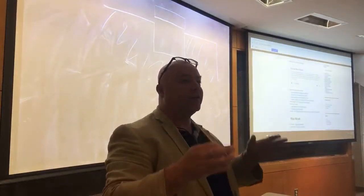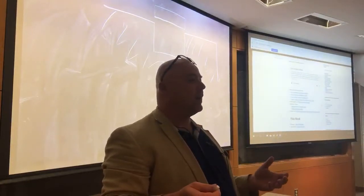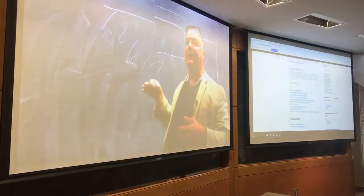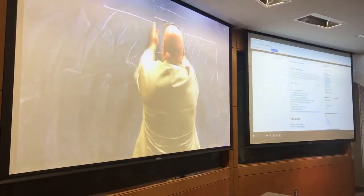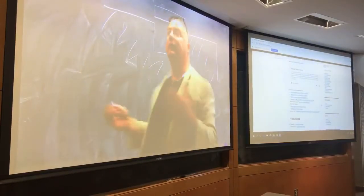In fact, on Thursday's lecture, we're going to talk about tolerancing and GD&T, and how to determine how much bigger it needs to be, and how much force it will take to press it in if you know how much bigger it is. So the bearing's got to be a little bit bigger. When it gets in there, it expands this material out a little bit, and it holds it in place, so you don't need anything else to hold it.